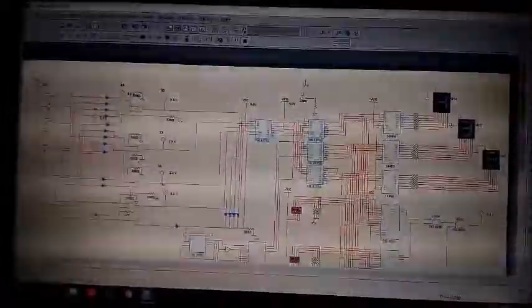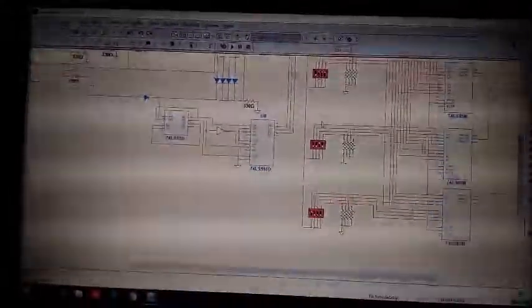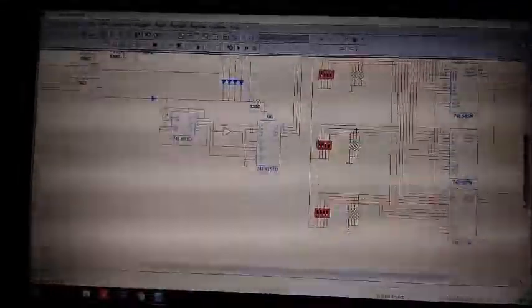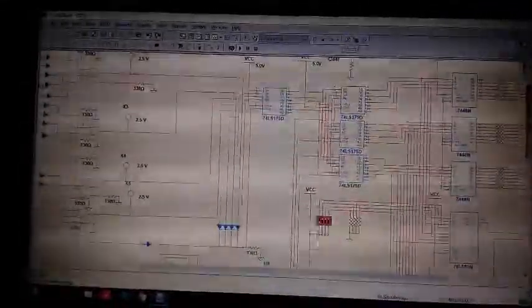The passwords are manual dip switches so that they can be varied. The input pins are compared to the passwords using 4-bit magnitude comparators. The output of each comparator must be high when equal. To determine if the output of the comparators are high, we use AND gates, and this is connected to the green LED.